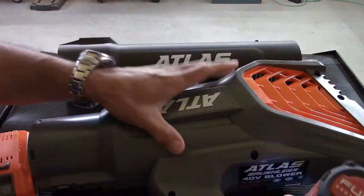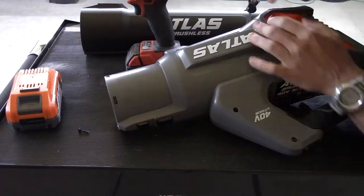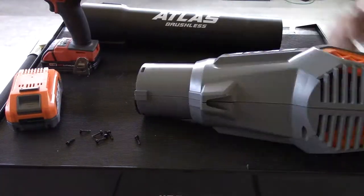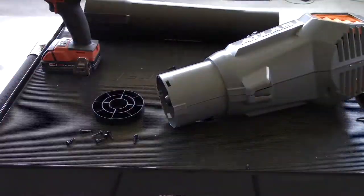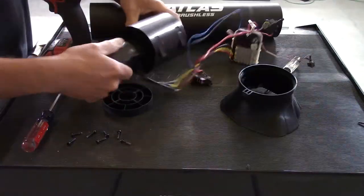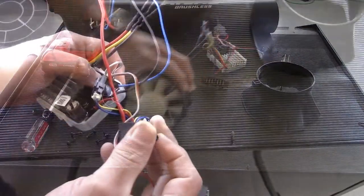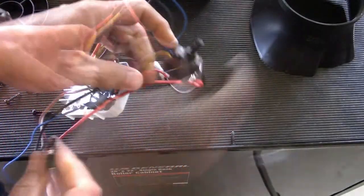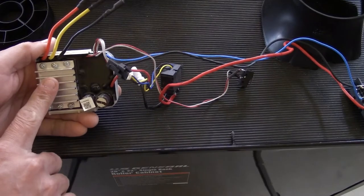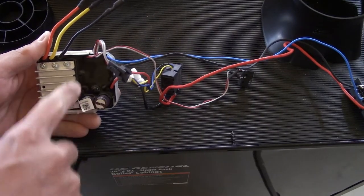It was now time to do with the tool exactly what I had planned all along — open it up and see what's under the hood. Removing screws and dismantling the tool is always the easy part. After removing the plastic covers, I found the usual suspects: a large three-phase BLDC motor with a powerful propeller, a trigger switch and potentiometer combo, a normally open push-button switch, and the black box I was dying to sink my teeth into.